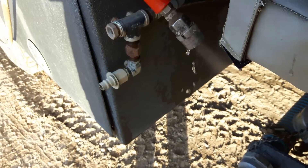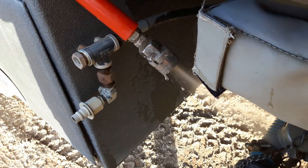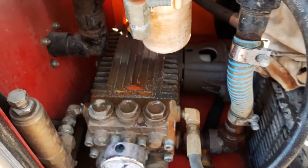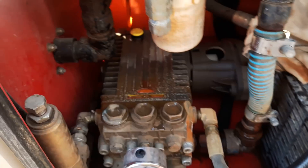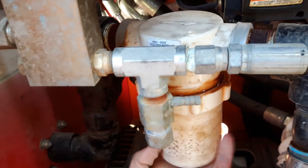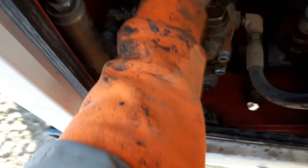You're going to get — you can see here — the last bit of water coming out. This is mostly air; I've already done this prior to taking the video to speed things up. Once you've blown the line out, you can take the water filter off. That's a simple one-handed removal right now because I put it on loose. Make sure it's clean, put it aside, check it, put it back in. It doesn't have to be too tight — the seal should keep the water from coming out anyway.